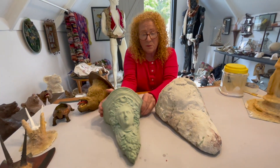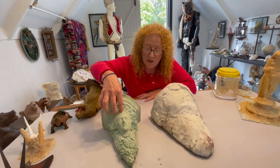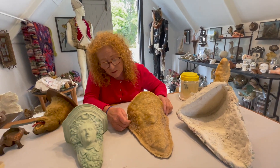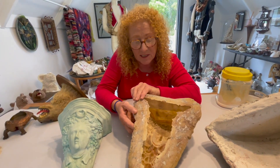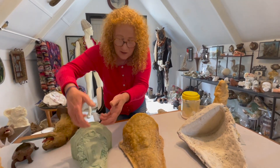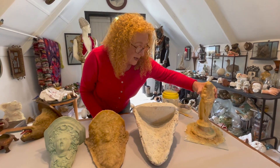It would require a two-piece mother mould, and if it was two-piece and went right down the middle of her nose we might have a bulging nose — so you just don't really want to have a connection in the middle of her face. I wanted a one-part, and to make that possible I loaded up the sides here with some waste latex — some grubby old latex. What that has done is made it a one-piece mother mould, not a two-piece. So you can build it up, and you must start thinking towards the end of your latexing how you're going to make a mother mould and how you will support it.